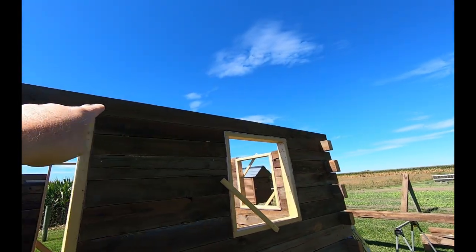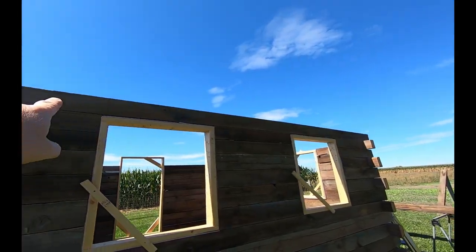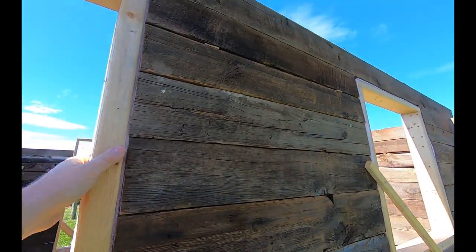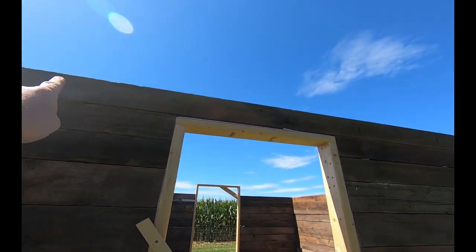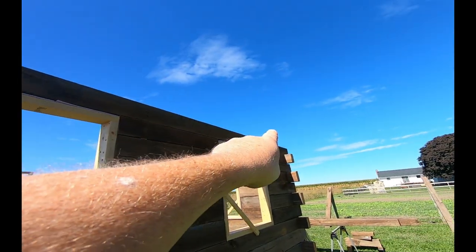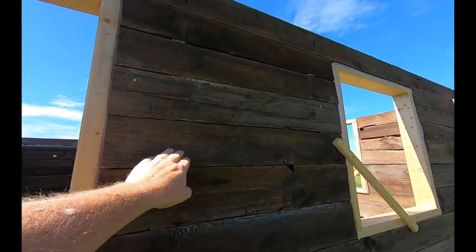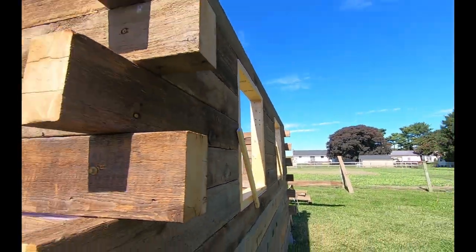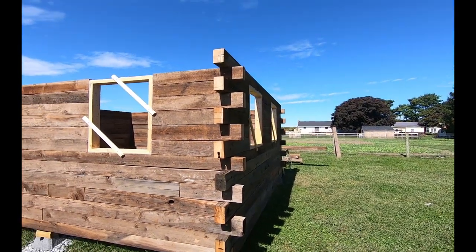I got the back wall course here in. That took a little doing because the wall, when you start putting these pieces in between the windows, she starts doing a little twisting, so we had to bring that wall back. I took a nice straight timber, laid it up here, attached it on each end, and brought these parts to the timber. So everything's nice and square now, and we can look right down that wall — she's nice and straight.